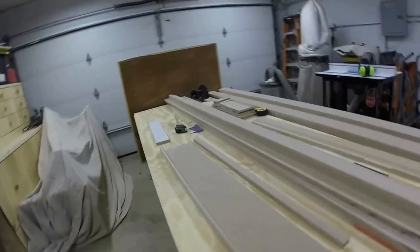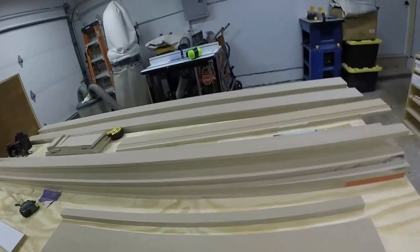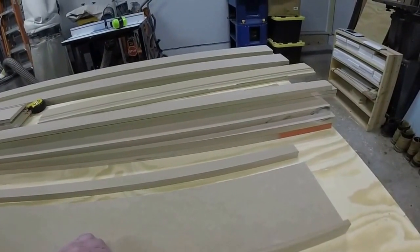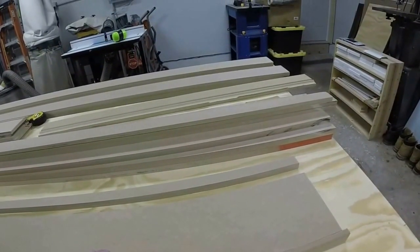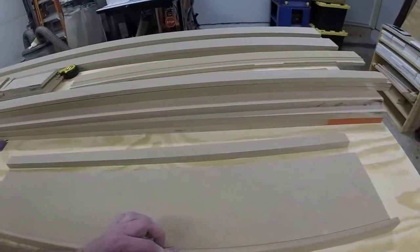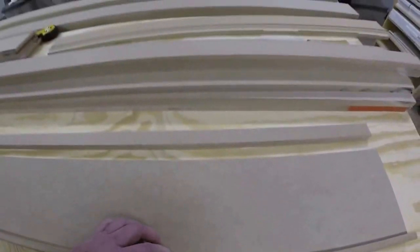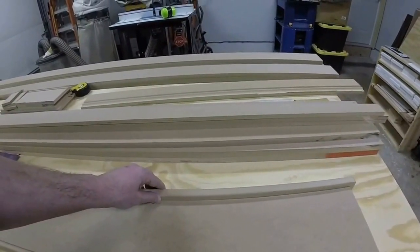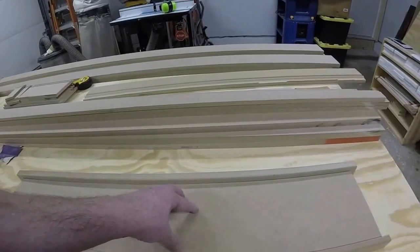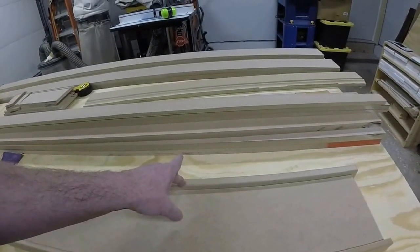So what we've done here is this goes over a door. So we've got a 6-inch piece we're putting over a door. We have 1/2-inch MDF that is cut inch and a quarter. So the profile is it'll stick out here. On the top, we've got 1¾, but it's 3/4. So we got 1/2-inch, 3/4 MDF, 3/4 MDF.